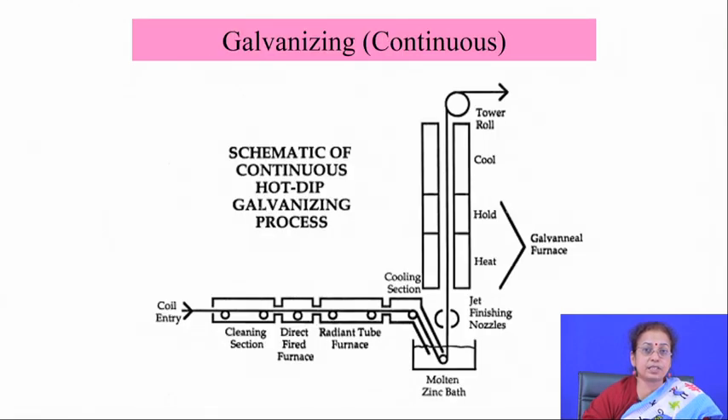One of the biggest advantages of hot dipping is that you get a completely dense coating with very few defects on the coating surface — except for spangle formations and some microstructural segregation. Apart from these, there are no significant defects observed in the hot dipped coating.